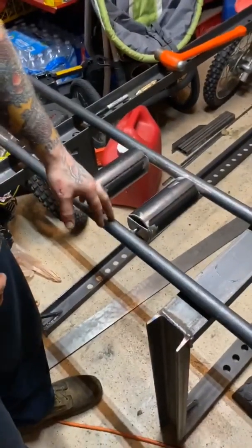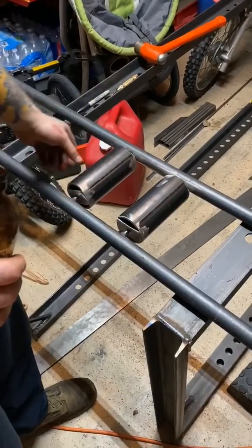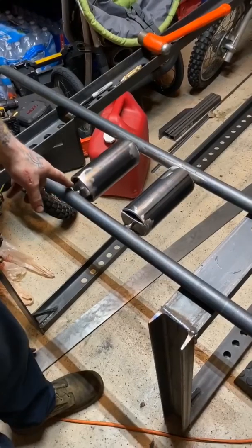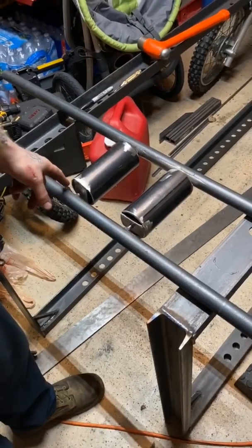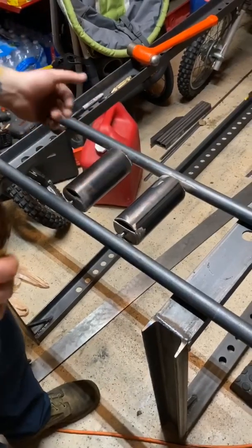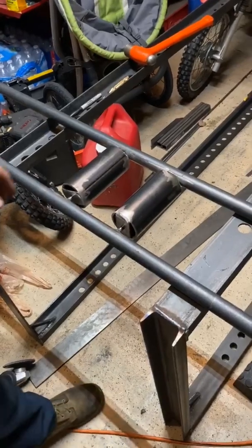With better light, you can see I'm going to punch through the quarter hot roll solid. This is 2 and 7/8 schedule 40. I put some quarter inch plates on the ends of these, then center punched them and drilled them to accept some drill rod, essentially using it like an axle. This kind of serves two purposes.